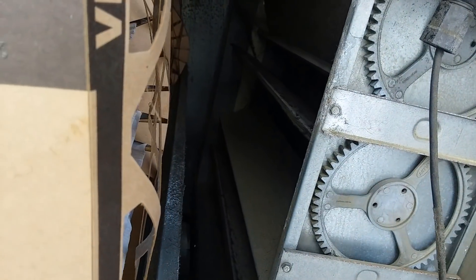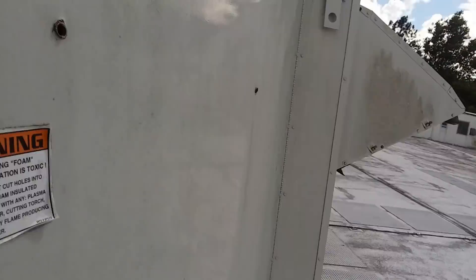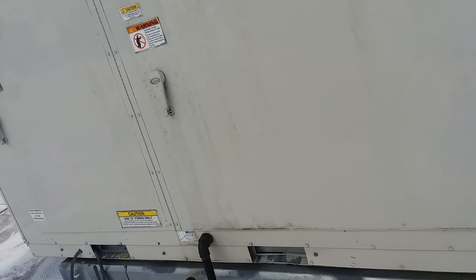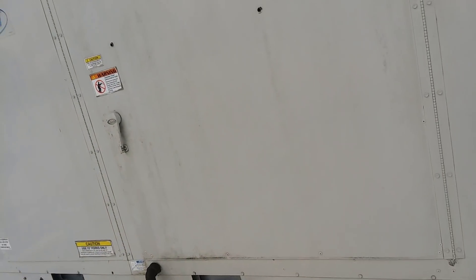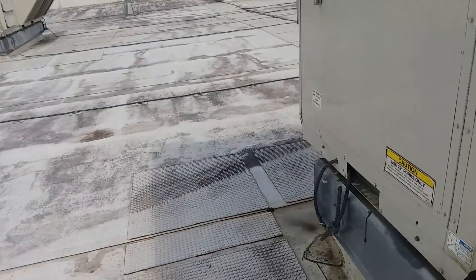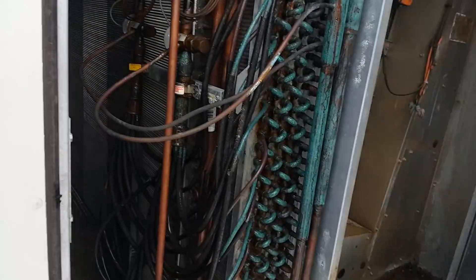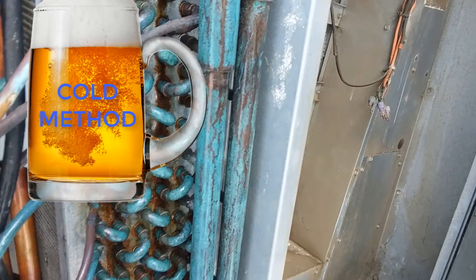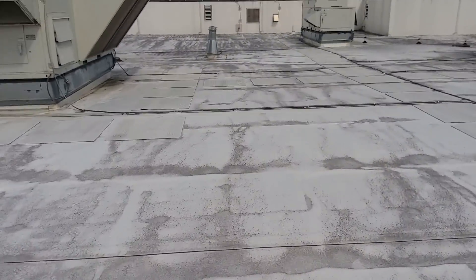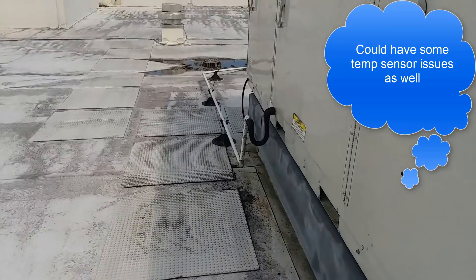It's probably not supposed to be that way and it's probably kind of against the law - some kind of CO2 emissions or something. But guys, we have two air makeup units up here. There's one there, there's one there. This one does the hallway, but the front door is constantly being opened. I didn't shut the dampers all the way, so it's still getting some fresh air. But as soon as I closed this up, went around and checked the other ones, came back to it - this thing is just wetting all over the place and cold as ice. Not freezing up, but cold enough. Closing the dampers fixed it. It was pulling hot air in and it's humid. It's not working at all otherwise.